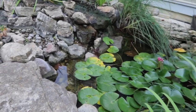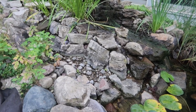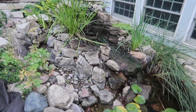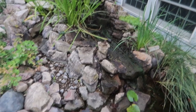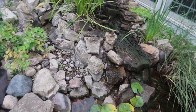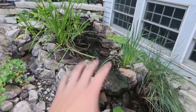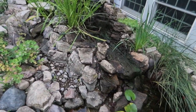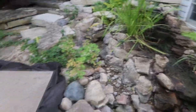We have a small little pond off this patio right up against this house, and we are going to be redoing this waterfall. The homeowner two years ago said that it's been leaking, and finally we're coming out here, tearing out all this rock and gravel and this old liner, putting in a new piece of liner. We're going to save all the plants, drain some of the water out, pull all these rocks out, stage them on our mats, and then come in with some bigger rocks for our character stones and waterfall and give it the Aquascape touch.